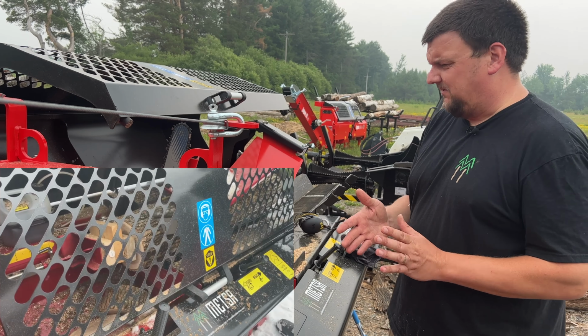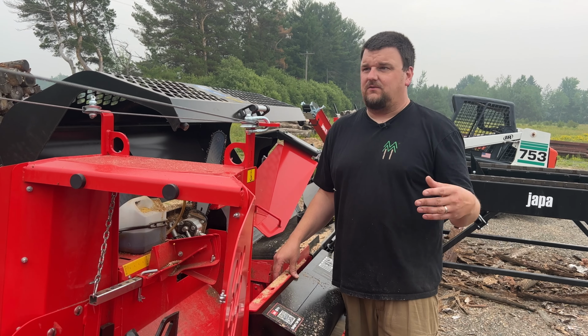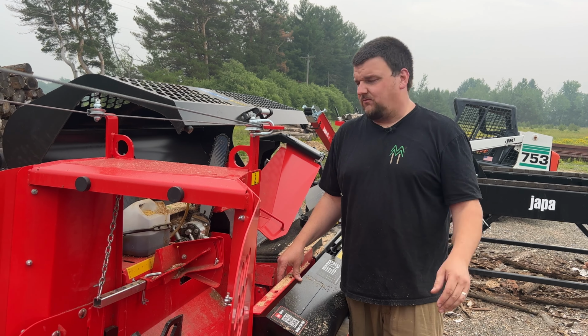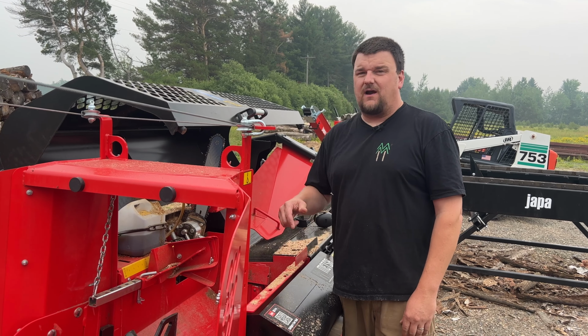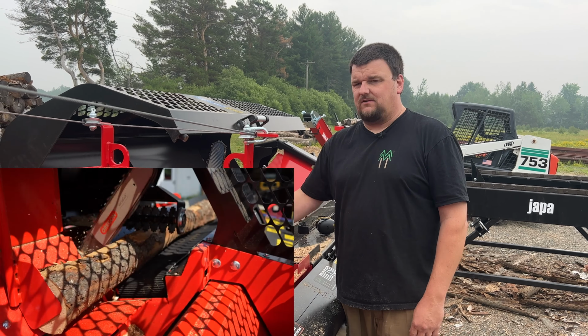But it's nice to have that because you know that every time you're cutting your log, you're getting the same length. To some people it doesn't matter, but to customers with restaurants and smokers and things like that, they want the most uniform they can get. And when you get into our higher end processors, they actually use a hydraulic log stop. So it's not positive like this, it's not solid, it's a paddle, and that turns the infeed off. So again, you get the same length every time.